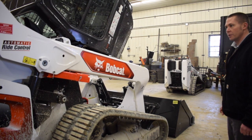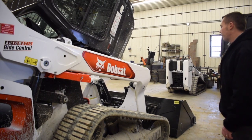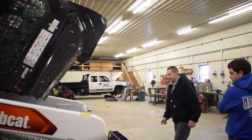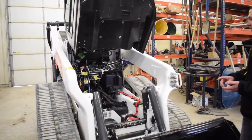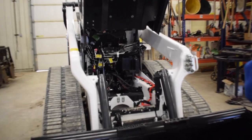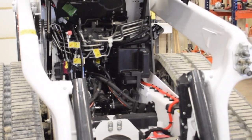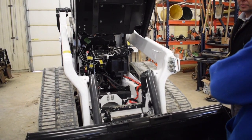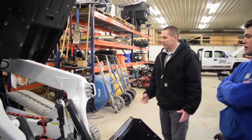The machine is still 80 inches wide, just like the 650 was. Looking at the underside, it's been cleaned up drastically from what the old machines were — it's very clean and organized. There are minimal hoses; hoses are only used where they have to be, and most of it is tube lines. That gets away from the 90-degree fittings you'd have with hoses. The hydraulics are more efficient, and if you've got to change something, it's all right there and not too tight to get a wrench in.